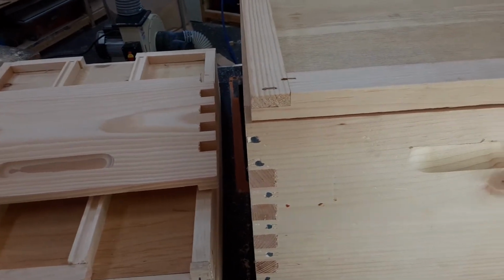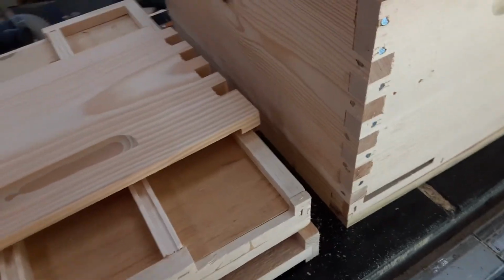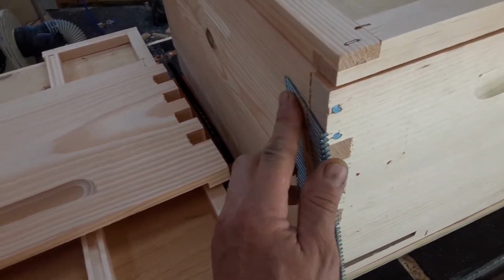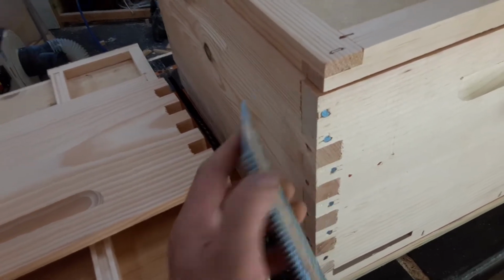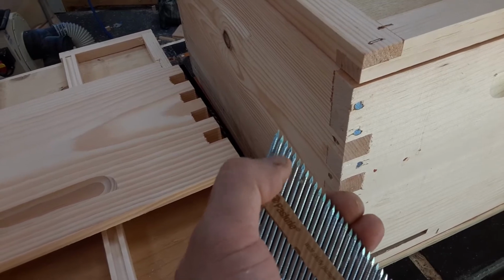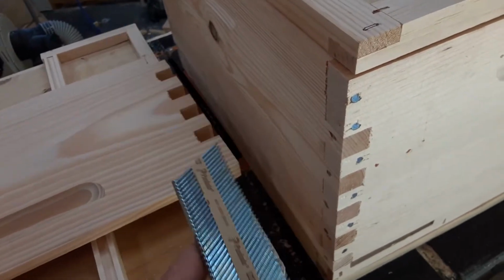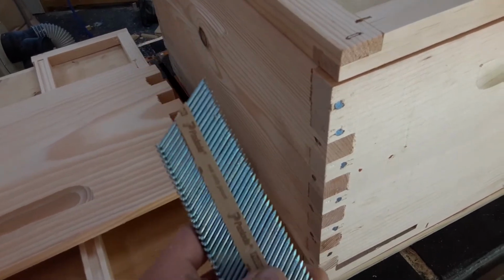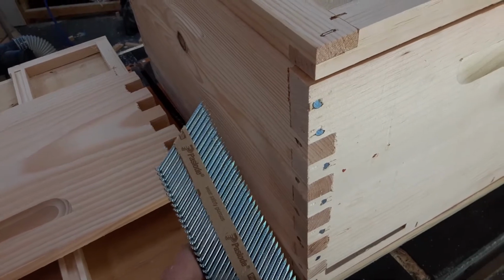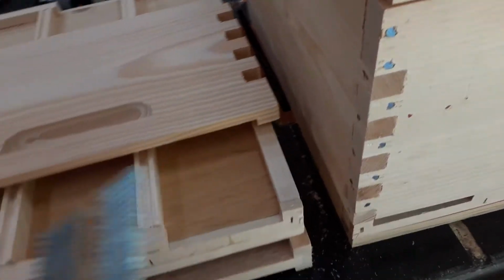And that's actually not good, right? So a ring shank nail, when it drives in, is relying on the compression of those wood fibers to backfill all those holes where the rings are. So if you're pre-drilling it, you're reducing that compression, and essentially it's not going to work as well. So just a little side note there on what I've noticed.